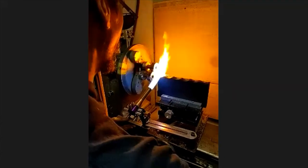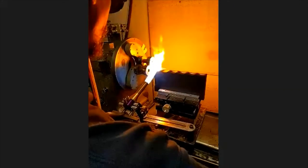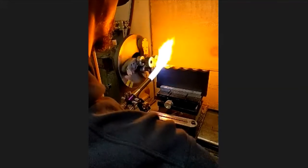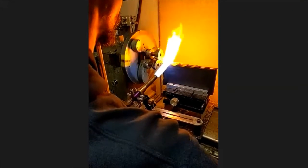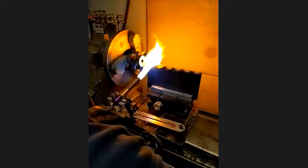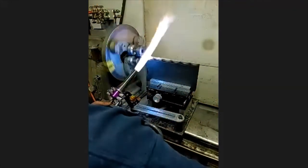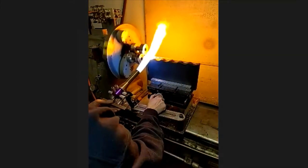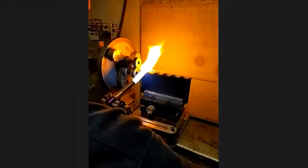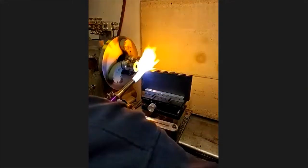Yeah. This first one tends to get a little away from me because it's supporting no glass. When this first bubble comes in, it's going to support all the rest of the glass. Okay. And I can dial this up that eighth of an inch in order to make it come back out center. I know the top of the graphite is true to where I want it, so the glass is all going to fill into that mold.